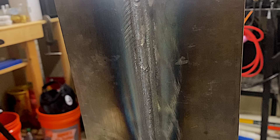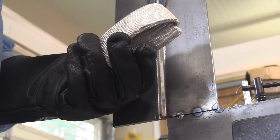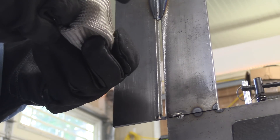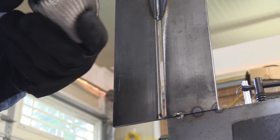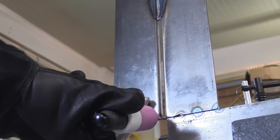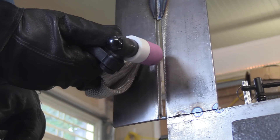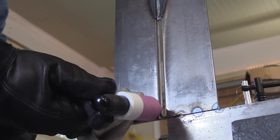Here's a quick look at the back side. Now let's do the bottom half — we'll freehand it with a tig finger, trying to keep everything the same. Still set at 100 amps, still going to go full pedal, which will give us about 97-98 amps. There's one side of the tig finger that has multiple layers of material, and that's the side you want to prop against the hot metal. For this weld it's going to slide in there pretty nicely.